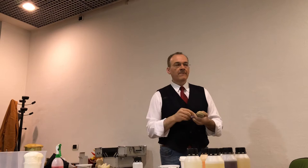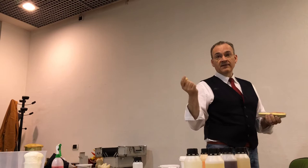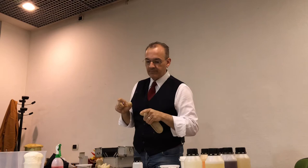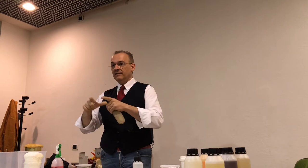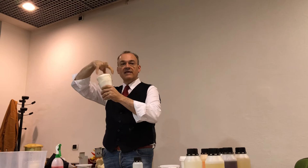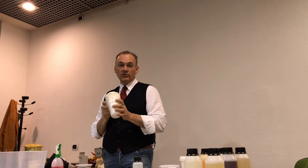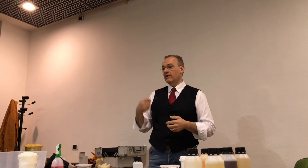Expanded polyurethane, I told you, has the little problem of expanding with super, super pressure inside, okay? So when you use it, there are not a lot of tricks. The best one is that you make molds open like that. You give some part that can expand freely and put out some of the pressure, unless you want to spend a lot of time making a super, super strong mold. Okay, it is not so difficult to make it, but it requires time, requires money, etc. So you can have some problem in production.